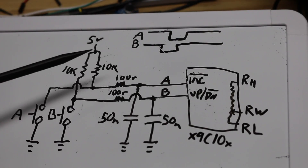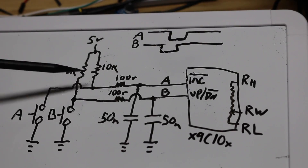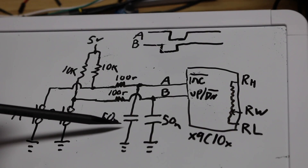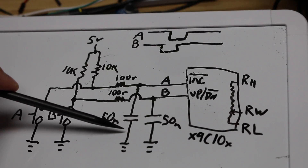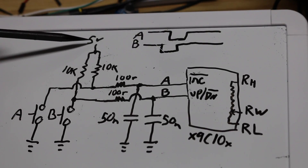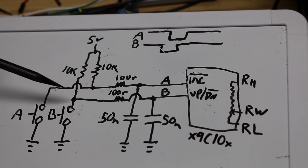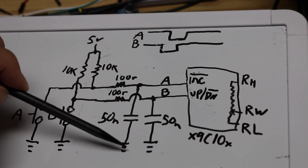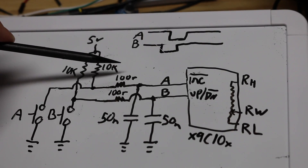What's actually happening in the circuit? This is the rotary encoder A and B switches. They have an on-board 10k pull-up each, but we want to do the debounce. 10k times 50 nanofarads equals about 500 microseconds of charge time to get to about 66% charge toward 5 volts. So if these switches are being pressed and everything is stable — the capacitor has been discharged through the switch to ground — then we release the switch, the capacitor is connected through a 100 ohm and a 10k to 5 volts, and it will charge up at about 500 microseconds. The 100 ohm is relatively negligible in the time constant compared to the 10k.